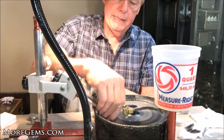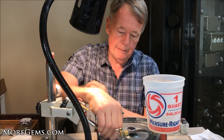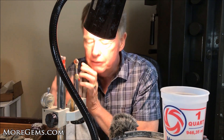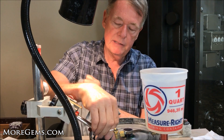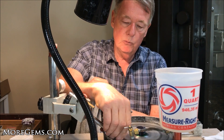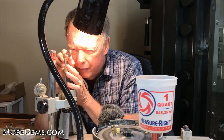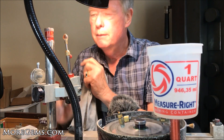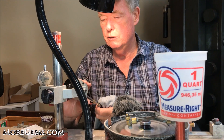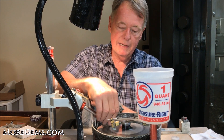Because I cut in two steps, I go from my Raytech 325 new bond lap to polish, it takes me a little while longer. If I went one further step and recut everything on a finer grit, it probably wouldn't take so long to polish, but I also skipped one entire step. You're probably going to want to polish from at least 3,000 grit on a metal lap. The Raytech laps I'm using — I think they've quit making them, which is unfortunate because I'm going to have to change how I cut.